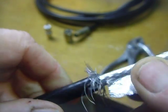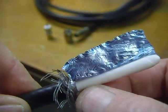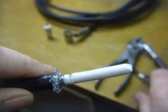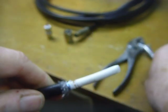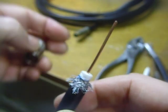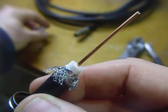Then this one here you peel back. I used my headband magnifier — a 10-power magnifier — to find the little joint and peeled it back. You can also just cut it off with a knife; it takes a little work. When you get that foil off you've got this. Then take your knife and go around the center, cut all the way around, and take off this piece. If there are any pieces of foam on there, clean those off. Always be sure to put your coax shell on your coax first so you don't have to take it apart and do it twice — like I've done more than once.